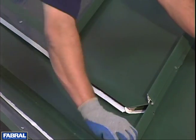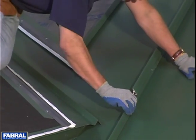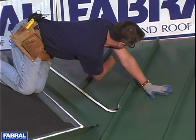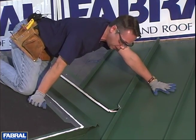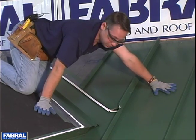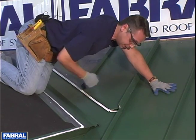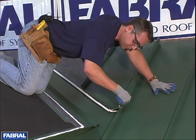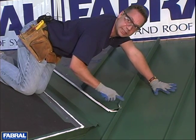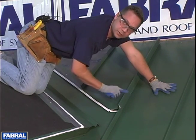We want these two panels working as one unit — we don't want them moving independently. A way to fix this panel is to attach it to the upper panel, which is fixed at the top. Once you snap this in place, put some pop rivets — I would put one every two inches. You want to get at least five or six of them in that 12-inch run. Pop rivet the seams together. Make sure that you pop rivet on the lower portion — you don't want any penetrations where your seal is. That way, if any water gets into your pop rivet, you still maintain your seal.